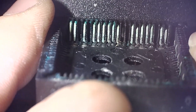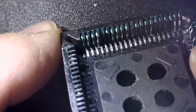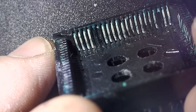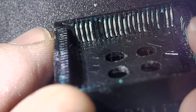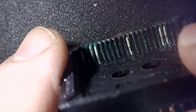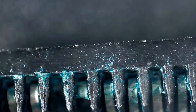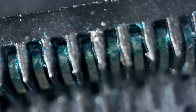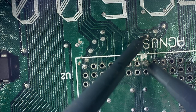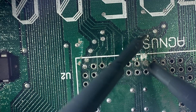Also, there is some corrosion or water damage - you can see the pins aren't a silvery color, they've got a white powdery substance on them. There's a split pin there - just checking continuity, and as you can see there is definitely a broken track.